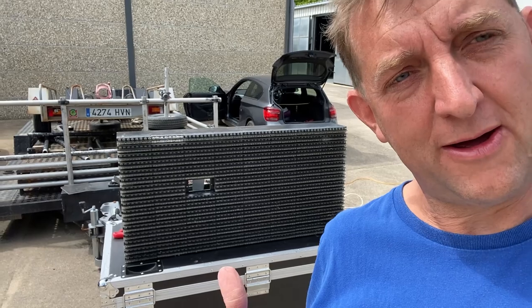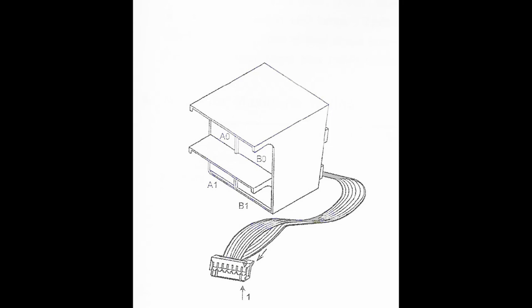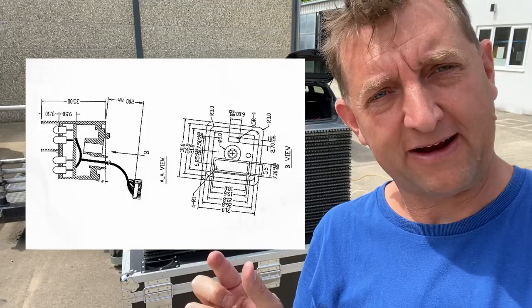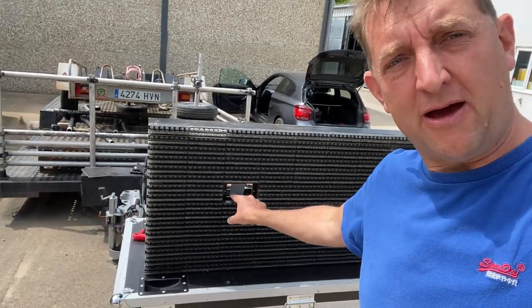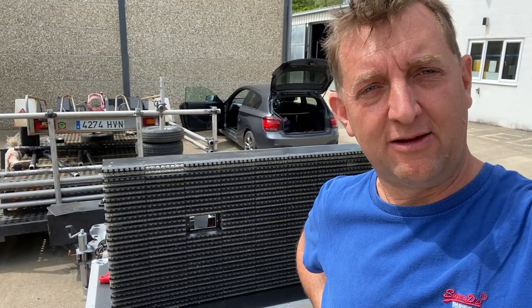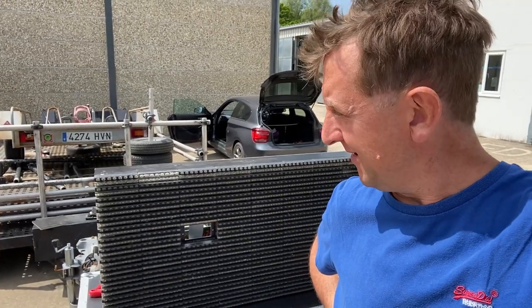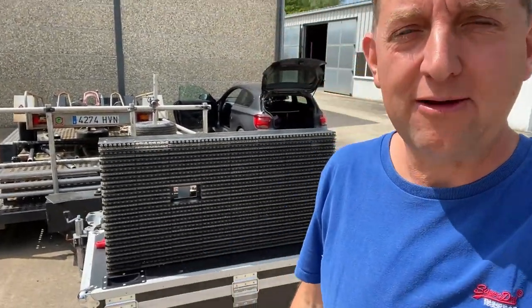At the time, there were LED clusters being made by, I believe, Kotko or Cree. But they were a square form factor, they were a cube, and they could not fit through the hole that was left in the chassis when a cluster was removed. Those had to be lowered down the front of the screen to somebody waiting on the ground, who would then tie on a replacement one on a piece of string or a piece of fishing line, and the technician at the back would have to haul it up, pull it in, and that was the only way you could replace those clusters from a rear accessed screen.